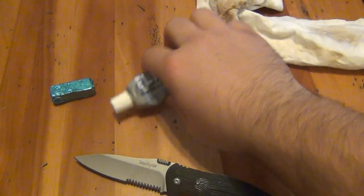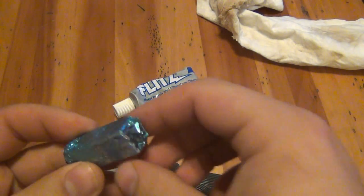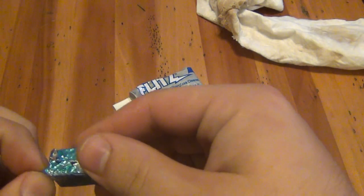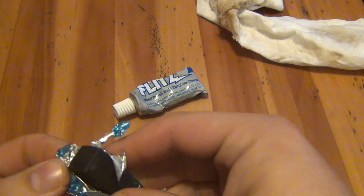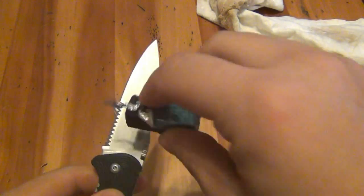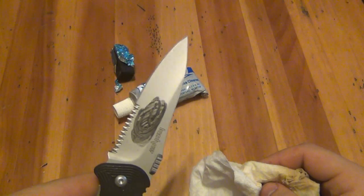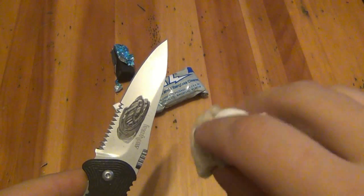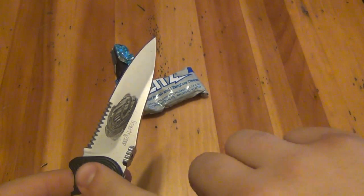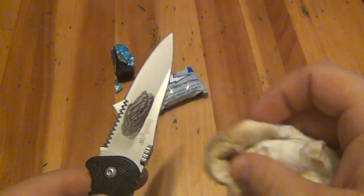Trying something different here. I have my Flitz, but before I try the Flitz I'm going to try a little bit of polishing compound — this is a rouge for strops, and it is an abrasive. Being abrasive, it's basically a liquid with a very, very fine grit. So it's polishing at such a fine level it's not taking metal off, it's just smoothing it out. I'm thinking if I smooth out the whole side here I'll get an even finish and remove those rough spots.